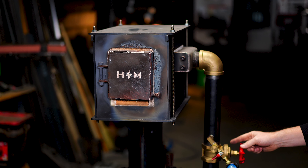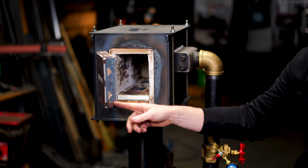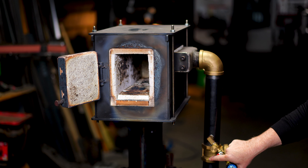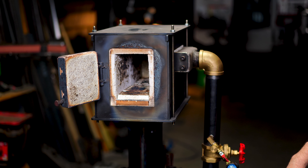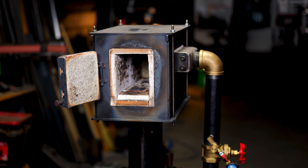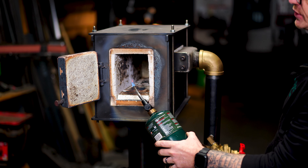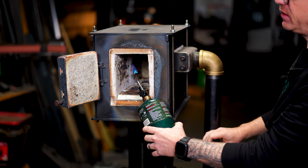Air is flowing at about 50%, propane at about 2 PSI, ball valve closed, needle valve closed. Open the front door of the forge, then open the ball valve — remember, propane is now only flowing up to the needle valve, not past it. We need air flowing at all times. Grab a handheld propane torch to light the forge, get some flame going, hold the torch in the opening, and slowly crack open the needle valve to wait for ignition.